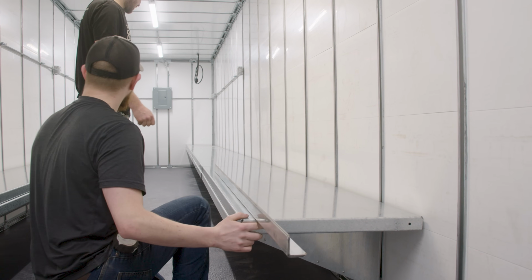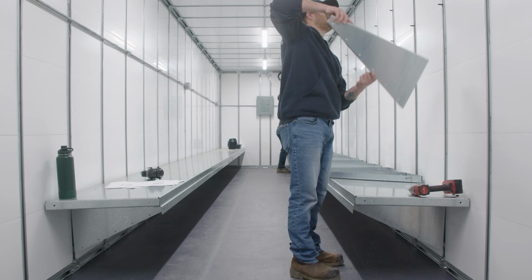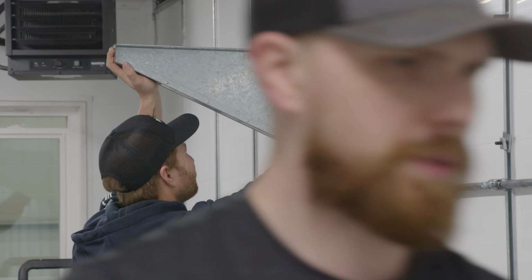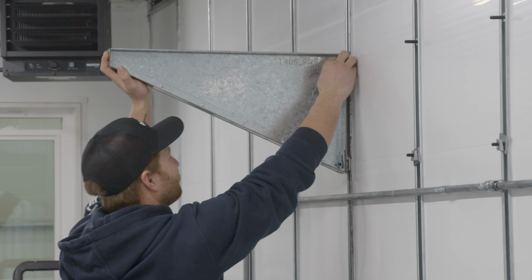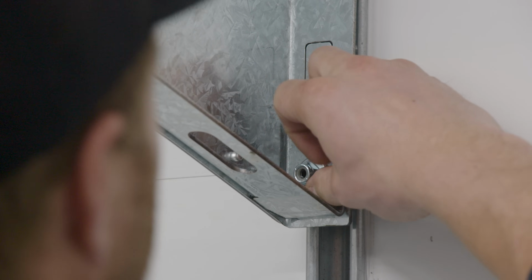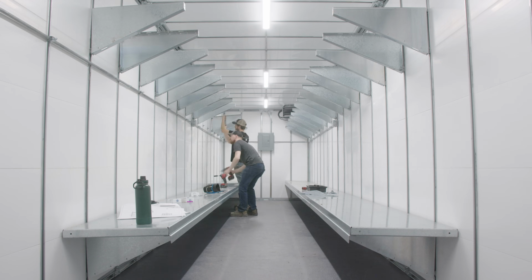We're getting smarter when we install these shelf brackets. We're now lasering in studs rather than trying to use spring nuts and bolts. This allows us to get everything perfect, and then we just got to lift up these shelf brackets and quickly spin the nut on. The next way we're going to retrofit this shipping container is into a change room.